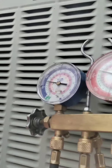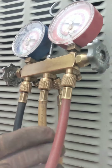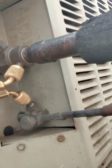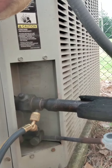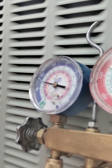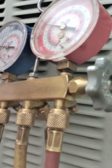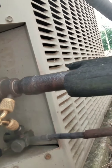Then back on your gauges, take your red liquid line hose and come down here to the smaller line — that's the liquid line, that's your small line. In air conditioning, you want to put the suction blue line on the big pipe, and your liquid line, the red hose, on the small line. It's just that simple, guys.